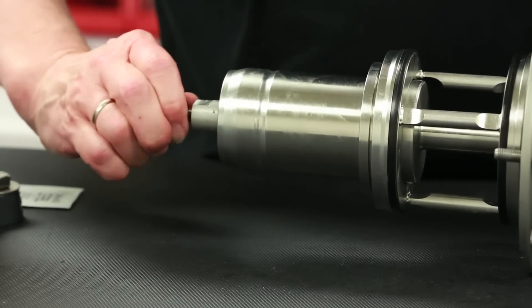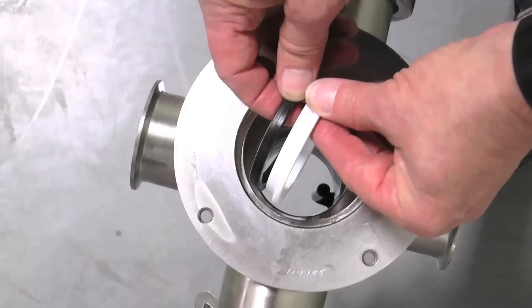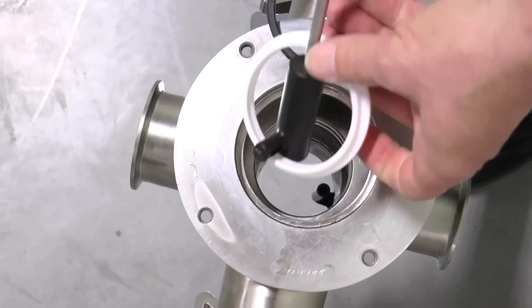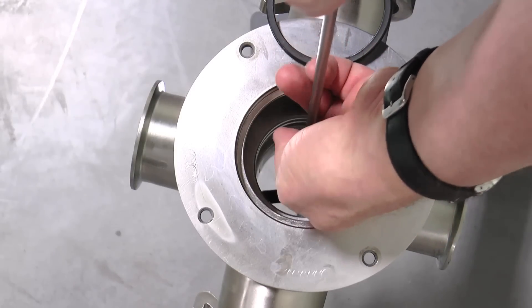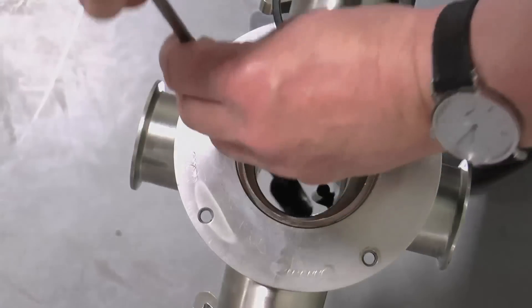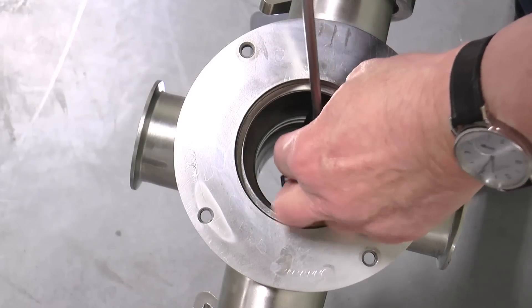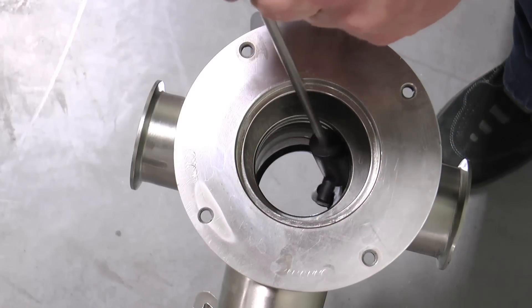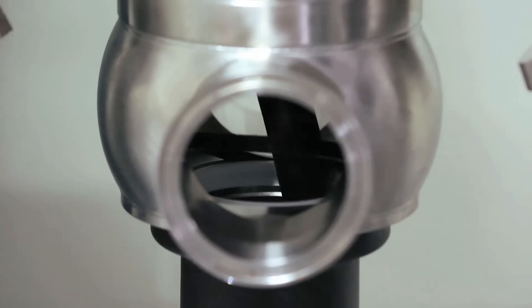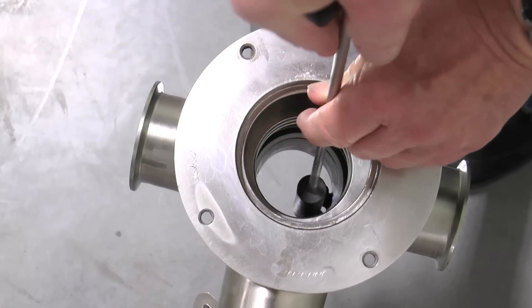Follow this by installing the safety nut below the lower shaft and tighten to a torque value of 40 Nm. Before the valve insert can be installed into service, the lower shaft seal must be installed back into the body. Like the upper shaft seal, this is a two-piece seal consisting of an elastomeric seal and PTFE carrier. The PTFE carrier will be installed first with the aid of the lower shaft seal tool. Install the larger diameter to the bottom of the body and use the housing of the tool to ensure correct positioning of the seat all the way around. Apply a thin layer of lubricant on the elastomeric portion of the shaft seal and maneuver the seal into position as was done with the PTFE carrier. Note that the widest part of the seal will face toward the bottom of the body. Once in position, use the housing of the tool to push the elastomeric seal into the groove and work all the way around until the entire seal is flush with the PTFE carrier portion of the seal.